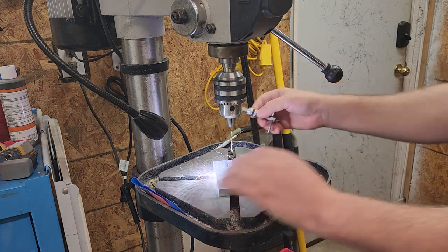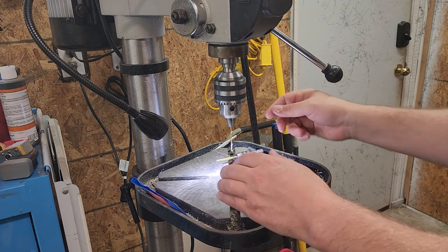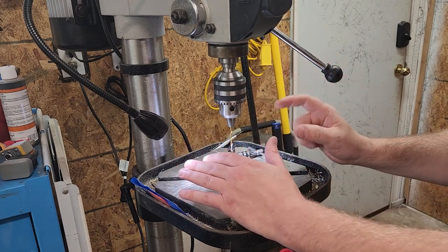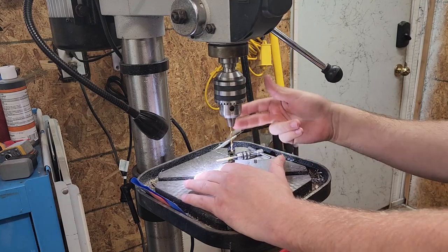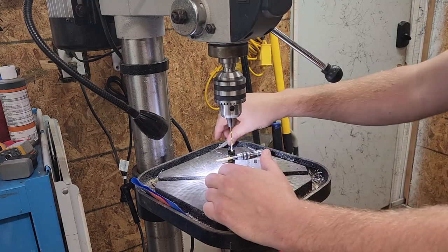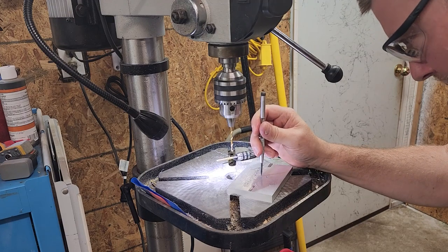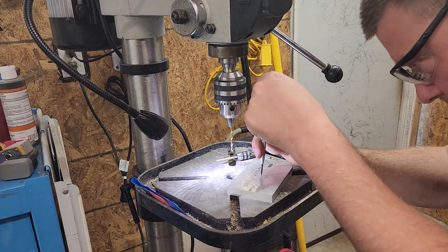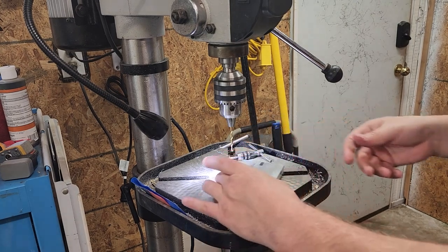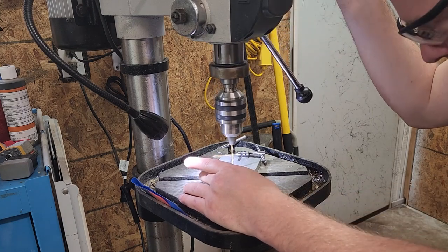Let's clean some of these shavings off and make sure the work surface is flat, because we have one more hole yet to cut and this hole is going to be a bit larger. Because it's a larger drill bit, I'm first going to cut a pilot hole. Since I already have this 3.3mm or one-eighth bit mounted up, I might as well use it to do my pilot for the next hole. I'll pick a spot near the middle of my material between the other two fasteners to drill our quarter-20 hole.